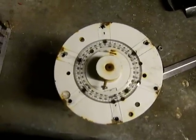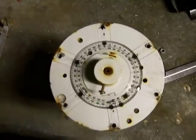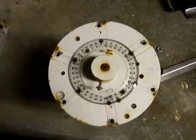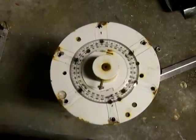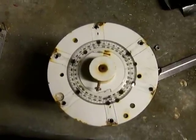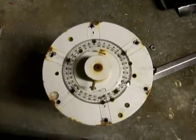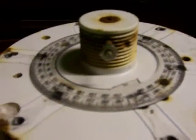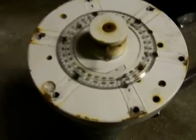The problem I encountered was I made a mistake and I put right-rotating blades on it. I didn't realize that the hub — I don't know if all of them are like this — but the hubs unscrew right side. So what I ended up having to do is drill a hole through the shaft and put a screw through it and a nut to keep it from spinning off when the blade started rotating. That was kind of a screw-up on my own.